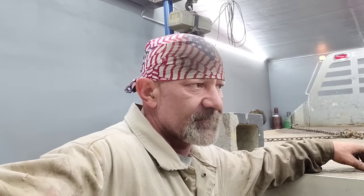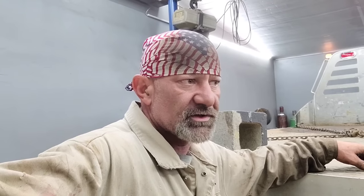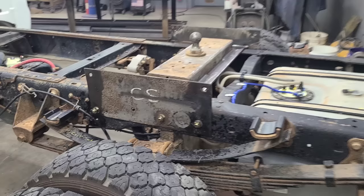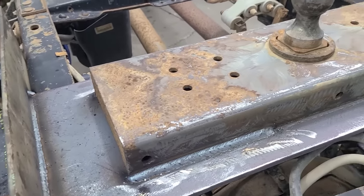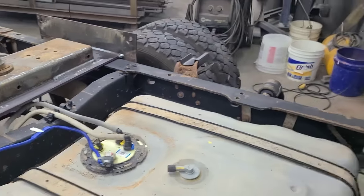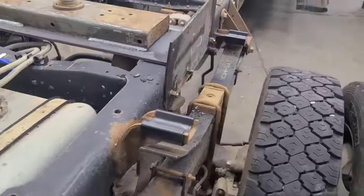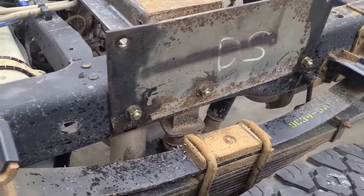So I got everything mag drilled where there's 5/8 bolts in each side of this hitch, and I'm confident with the hitch. So we take a look here at what I did with the hitch. I feel like those 5/8 inch bolts, they're grade eights, that's gonna be good.